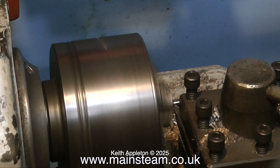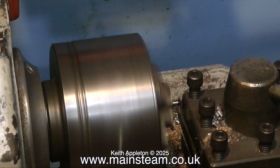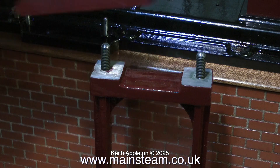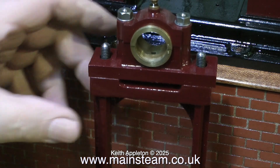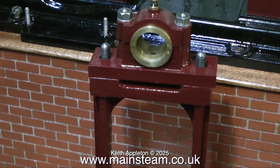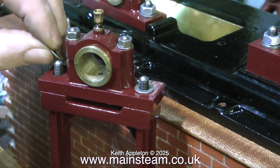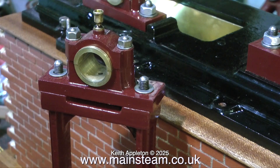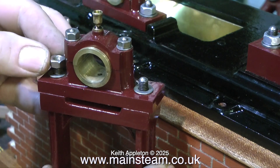The good thing is that once the bolt's head has been machined off, the stud will still be hard, making it a very good stud to hold the parts together. Here we have the finished pedestal with its studs fitted, and this is the top bearing going onto the studs. Those following along should notice that the top cap is on the wrong way around, and the main bearing itself is not machined equally at both ends — I will do something about that, but not for the moment.